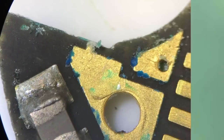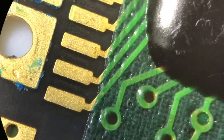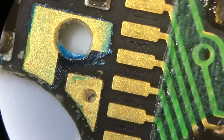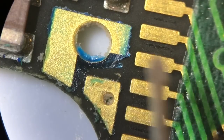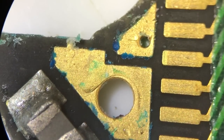We're now on the microscope. If you're interested, the scope I use is an AM scope 306 at times 20 magnification. What you can see here is the underside of the board - all these little rectangular parts are where the zebra strip would sit and take its power to the LCD. The cutout is where the battery is and where the leakage has been, so that's where I'm starting. You can quite clearly see some battery leakage, though I've seen a lot worse than this.